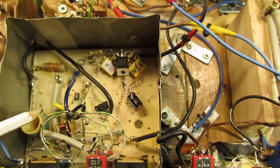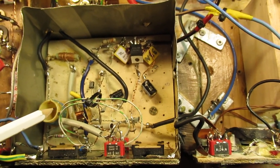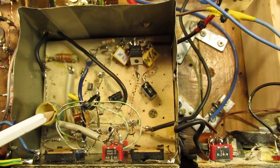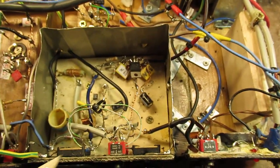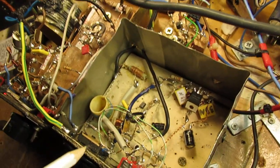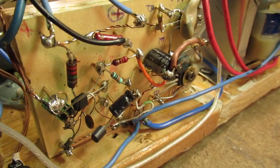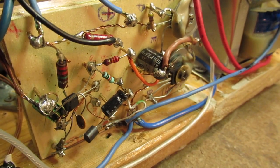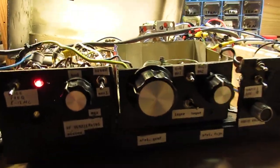This is the VFO, the variable frequency oscillator, or the local oscillator in American radio literature. Here the VFO coil. The VFO coil must be shielded on all sides to prevent the radio signal from straying out to the antenna coil, here the front end, etc. Well, this was more or less all. By the way, the audio end amplifier is approximately 1 watt, could also be 2 watt. Minimum is 1 watt.